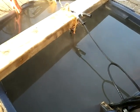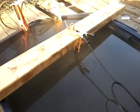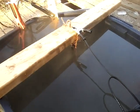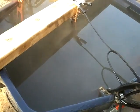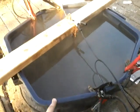Then I suspended the piece of cast iron inside the water with a piece of copper wire — that's actually from the same strip of wire. I just stripped all the plastic rubber coating off of it and used that, then I hook up my negative to that. Before suspending it, I filled this full of water — it was nine buckets. It's supposed to be a 40-gallon tote, but because it bows out, it actually took an extra five gallons.